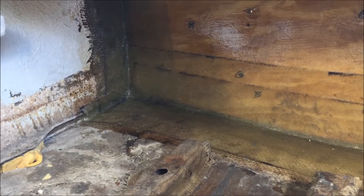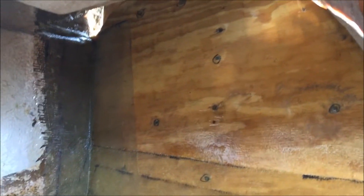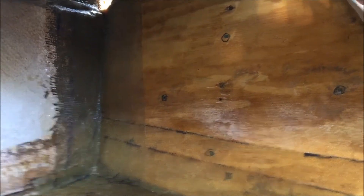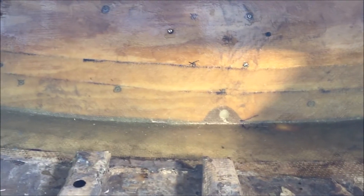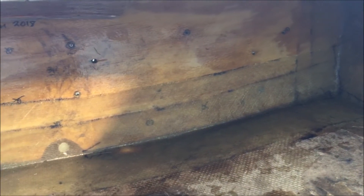I got the tabbing done - two layers of 1708 as you can see here. I went all the way up the sides to where the gap starts in the transom. I'm going to put some filler pieces in there. I would have liked to make that part of the whole piece of the transom, but there was just no way to get that piece of wood in there with all those little corners and up top without massively cutting the back of the boat. That's about how far up the original transom went - and it wasn't even glassed into the upper cap at all, so you could remove the cap if you wanted to, but I don't ever plan on doing that, so I'm going to glass it in and make it really nice and strong.